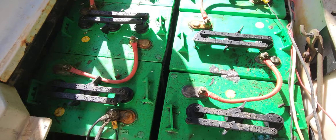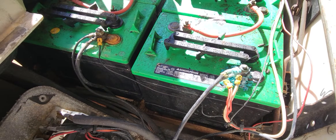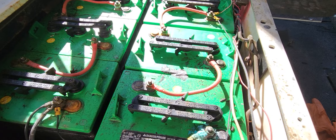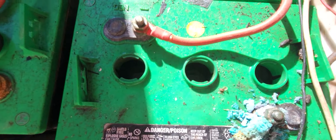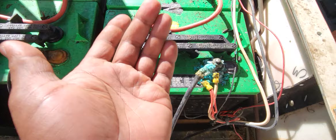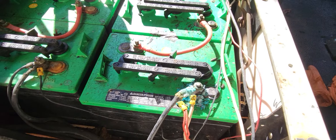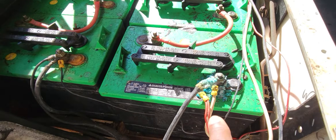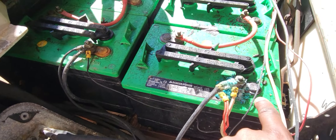These terminals are notorious for corroding up and breaking off. It doesn't mean the battery is bad because you have corrosion. Some battery brands are worse about accumulating corrosion around the post. We typically use Crown batteries, and Crown batteries tend to leak less than maybe a Duracell or even Trojan batteries. Also, when you take these caps off, sometimes people overfill these with distilled water. If you overfill them, when you charge them they will overflow and create a lot of condensation on top — and that condensation is acidic and corrosive, causing the terminals to accumulate a lot more corrosion.